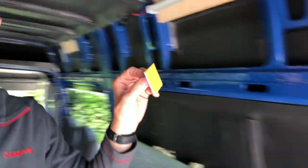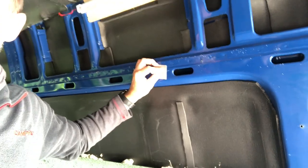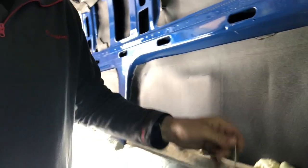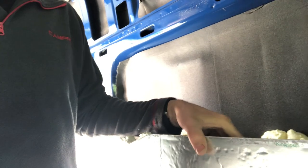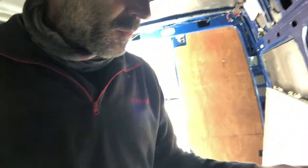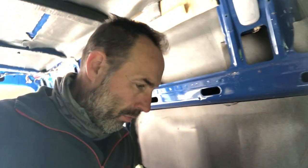I'm recording this on my phone. So yeah, these stick on the metal — I'll just do it on the side here like that. So the Celotex goes in — that's the roof — goes in, sticks flush like that. And then you've got a pack of washers and they go over it. Stops the Celotex from falling down. Don't have to keep buying expanding foam — it just holds it.